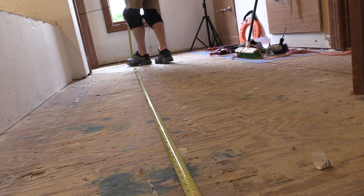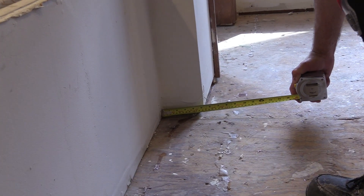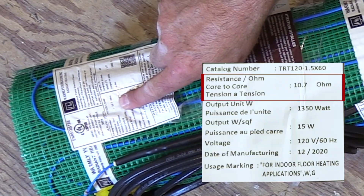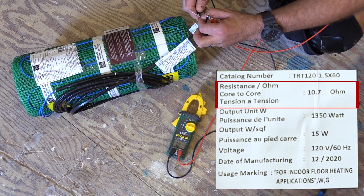When you're getting ready to do your Temp Zone Flex installation, make sure you get the correct dimensions of the room. Send us those dimensions in a drawing and we will supply you with a smart plan installation plan showing how to lay the product out. When you get the product, make sure you test it with a digital ohmmeter to make sure that the numbers on your meter match the product specifications on the label.